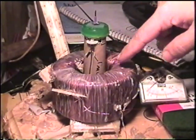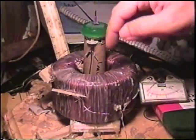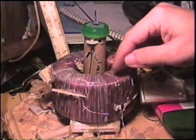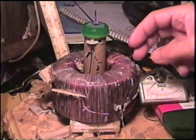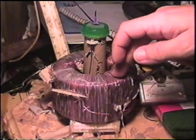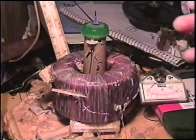The idea is that as this spins and the face of each magnet — so there's a north side and a south side — as this twirls, you're adding magnets to this steel coil. My idea was that if this is arranged axially opposite of the way normal motors and generators are set up, then we could eliminate the back EMF that's caused by the induced magnetic field in the coils that slows down or actually repulses the field of the moving magnet.